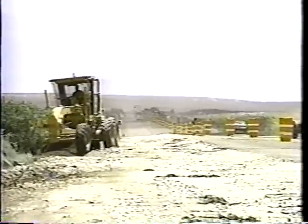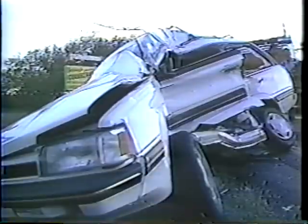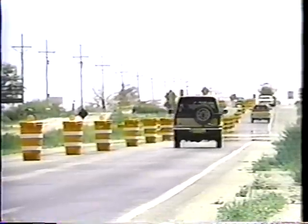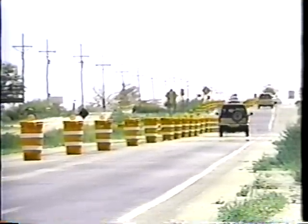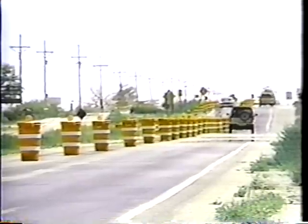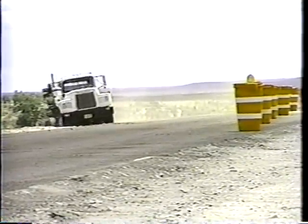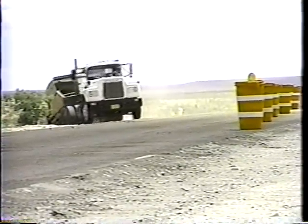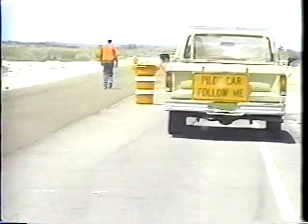Flagging is required when other methods of traffic control are inadequate to warn and direct drivers. Flaggers may also be required at emergencies such as traffic auto accidents, natural disasters, or man-made disasters. Flagging operations may be required in traffic control situations, such as when one lane is alternately used for both directions of travel, when the roadway is closed for a short period of time to allow for equipment movement or blasting operations, and when workers are close to a lane of travel without a positive barrier.